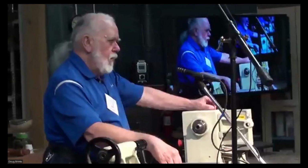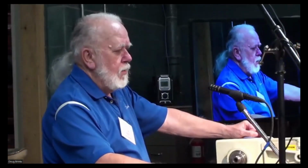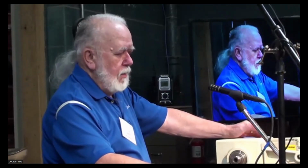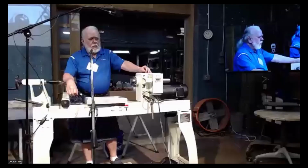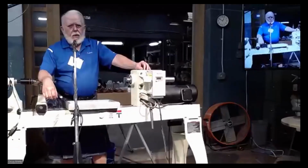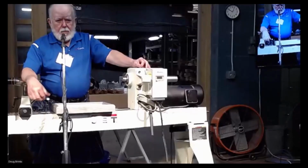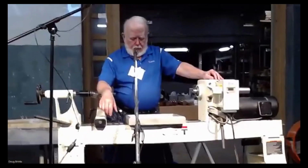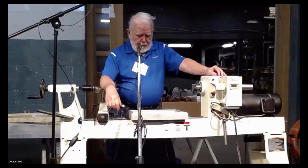All of our carbides are nano carbides, meaning small particles, and about 8% binding solution goes in it. They are pressed, then they go in for baking, and they're baked. They come out of baking and they are polished. We polish all of our carbide flat tops.